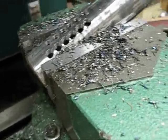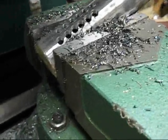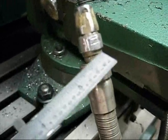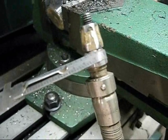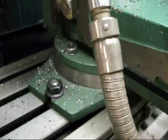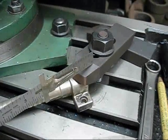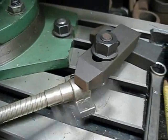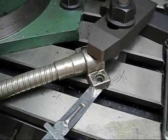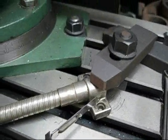I went to a yard sale and found an old high-quality desk lamp with a really nice flexible arm. I disassembled the lamp and this is what I came up with — it works really well. I did braze the two nuts together, threaded this part and this fixture, and brazed a 5/16 and a quarter-inch bolt together. They're fixed in there and I can just screw the camera right on top.